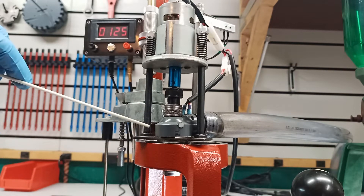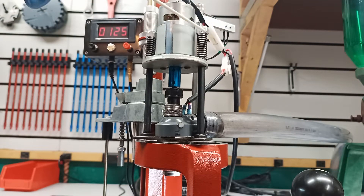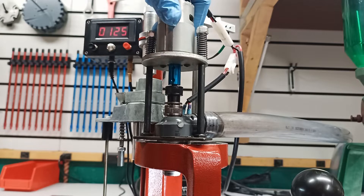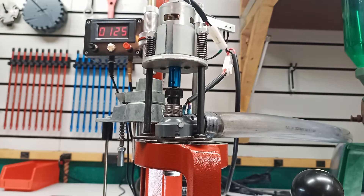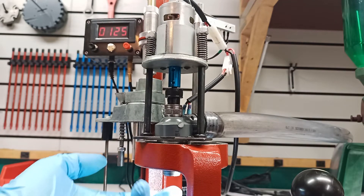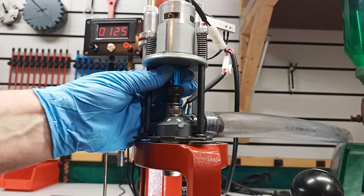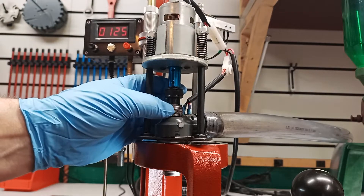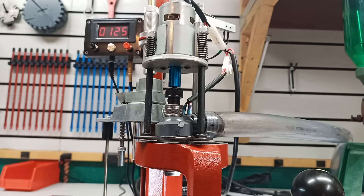That matching hole spacing means when you put the springs on here with these nylock nuts, the washer will spring-loaded float inside the cutter die. What happens is when the brass comes up through it, it lifts the assembly up, and as it cuts it settles back down. When it comes down against this stop, it's done cutting.